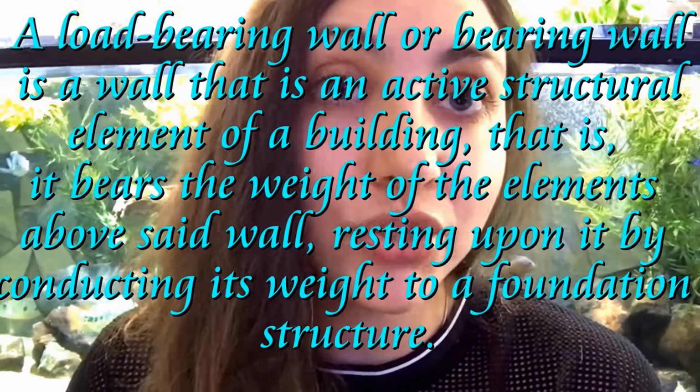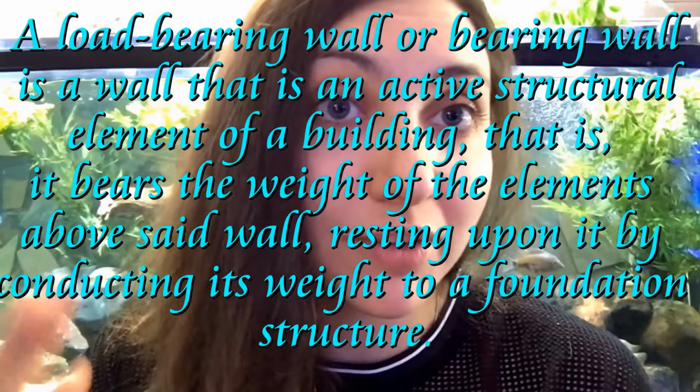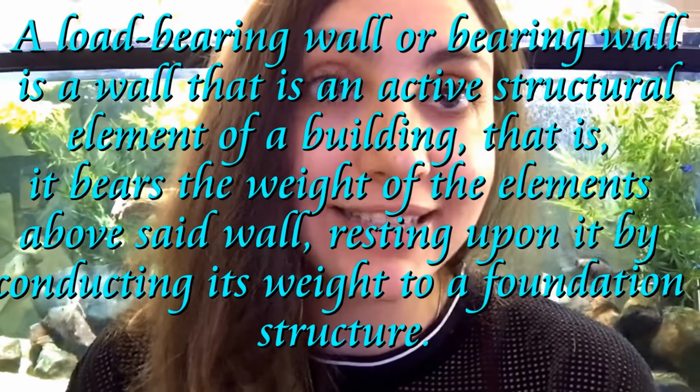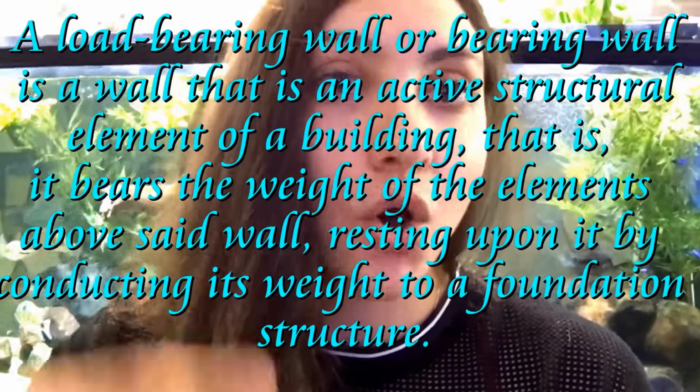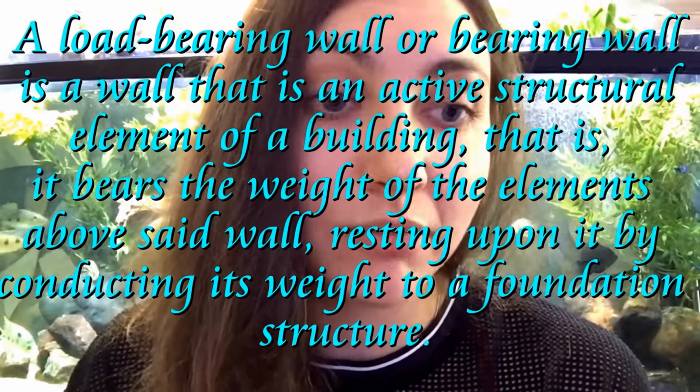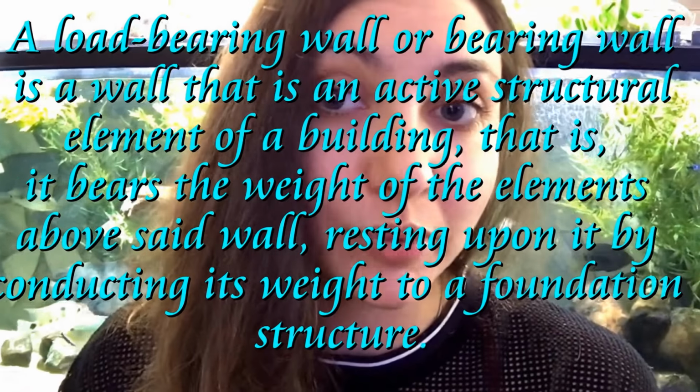You have to place your aquarium on a supporting beam wall, meaning there's good support to the structure of the building right where you're gonna put your aquarium. Do not place an aquarium on floors if you're not on a supporting beam, let's say in the middle of the room. Don't do that. If your apartment or house or condo is not made out of cement and you don't have a supporting beam in that location, don't put it there.